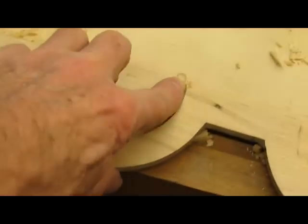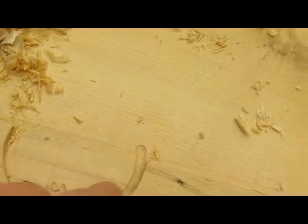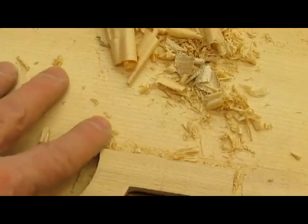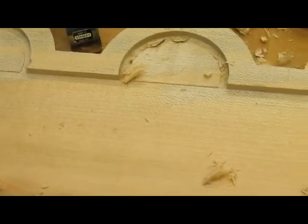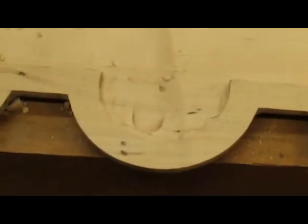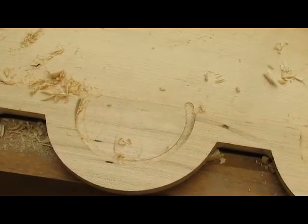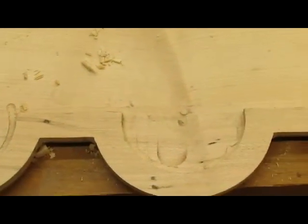The downside is that when I cut the quarter-inch circles around it, it looks like I must have tipped the router as I came off the template. So I have a little bit deeper groove all the way around, and getting that out and getting it smooth is a bunch of work — but it's coming along. I'm using it as a learning experience; I need some patience and I'm sure it'll come out just fine. Then I'll have two tops and can select from the better of the two.